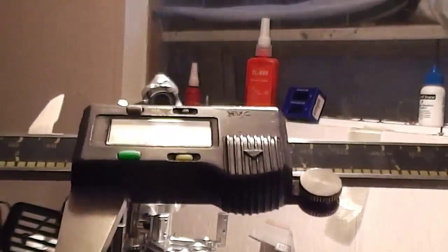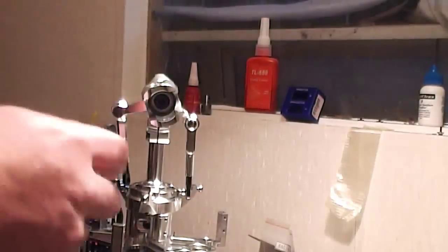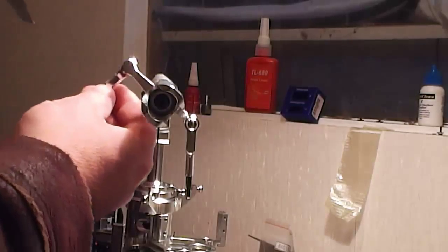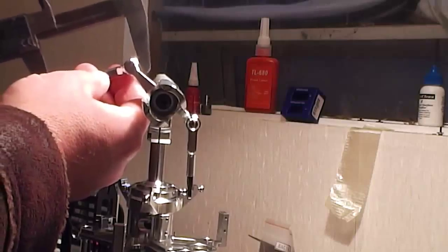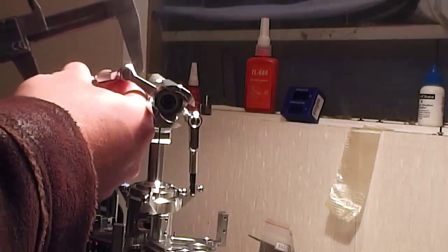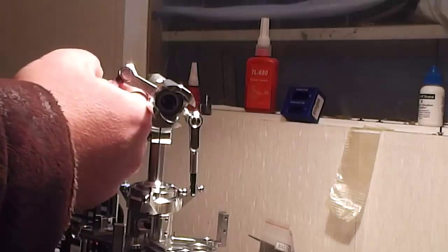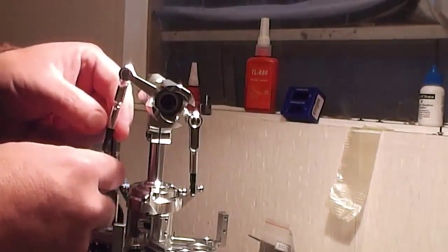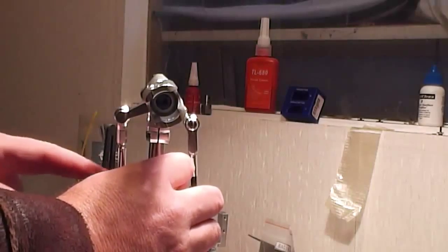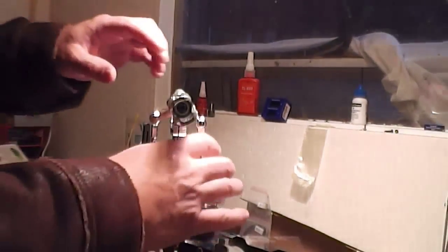The drop arm from the blade grip to the swash is 66mm, and we're just going to measure the distance from the bottom of the ball joint to the, as you can see I've got a fair bit of clearance here, so you just wind them out until you get that to touch. Like so. And then click that into place. It's got the SAB on the outside, facing out here. And click that into place.